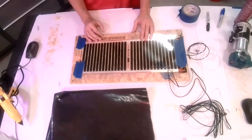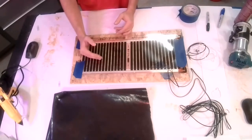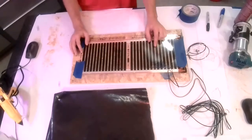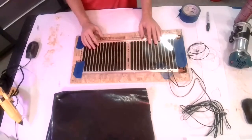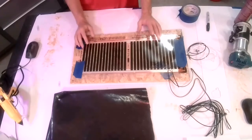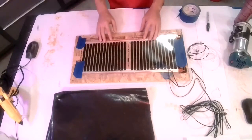What seems to be pretty typical is usually a couple of long strips, 20-inch wide, down the center, where it is the long kind of hallway section, if that's your layout, and then usually a couple pieces to fit in on the edge, whether that is the bathroom or the entryway or etc. That's pretty common. And usually you're under the area that can be heated on one or controlled on one thermostat, but that doesn't mean you always want just one.